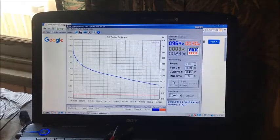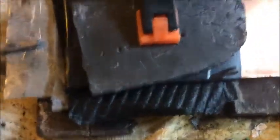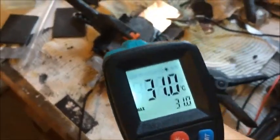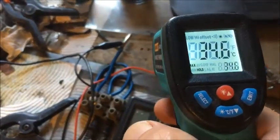Quick update: we're at 19 milliwatt hours and it's 29 minutes and we're at 0.964 volts. Still looking good — it's on schedule for doing 42 milliwatt hours by the hour. So far okay — it's only the second charge, so we'll give it another go. The cell's still holding up; I forgot to check the temperature on camera but it's getting cooler around the house.